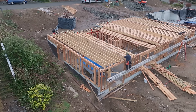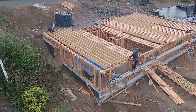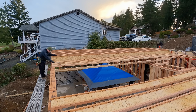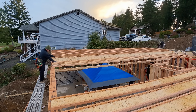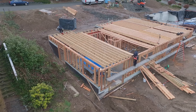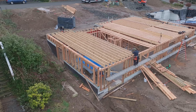These are very long joists. To actually flip these things up on the hill and get an accurate layout is a complete waste of time - I know because I've tried that before. When we got forklifts, life got easy. We brought all of these I-joists and put them into place off the pile, and I cut them right over the chalk line on the top plates. That way I could cut as they grab the next joist and we stayed in motion - by far the most efficient way. It only took us 15 minutes to set up the scaffolding.